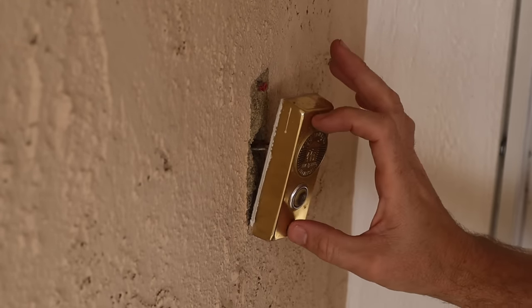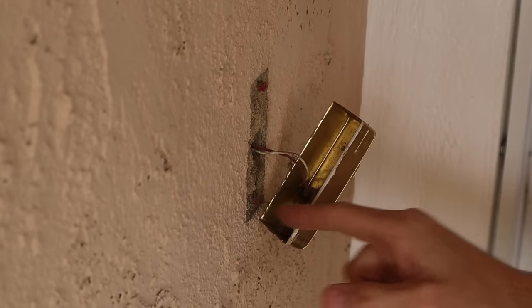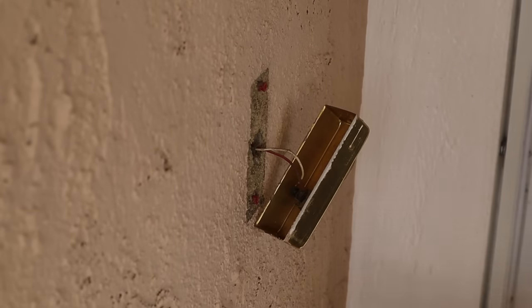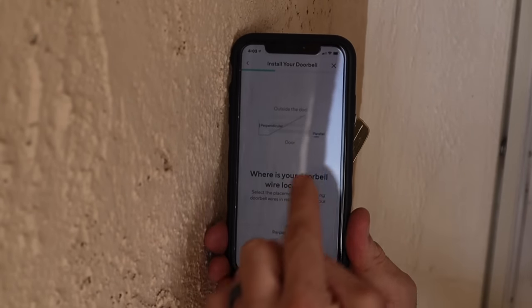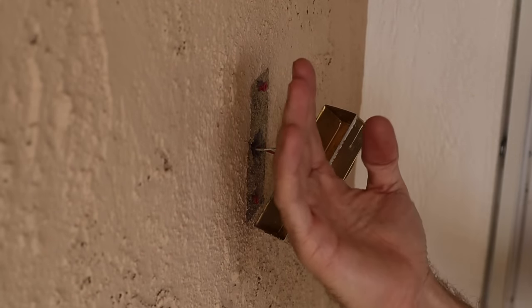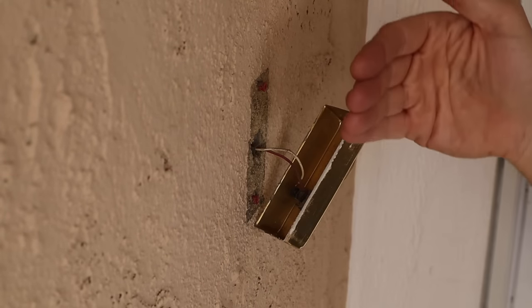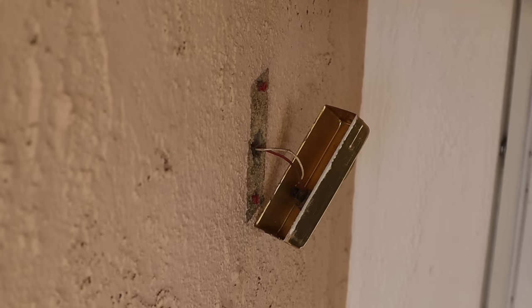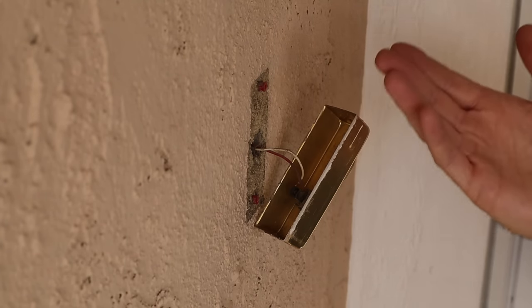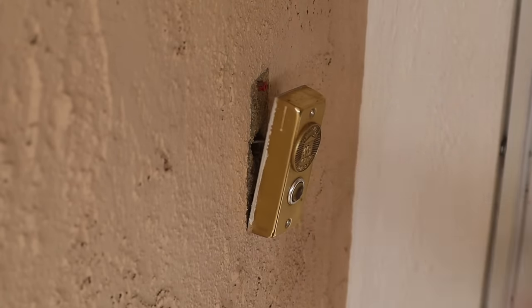So we've got it off. Your doorbell will probably have one or two screws underneath it and some plugs in the stucco. As a reminder, your phone app has the step-by-step directions, so if you're missing anything I'm saying here, you can always refer to your phone. The app is going to ask whether you have a perpendicular or a parallel mount. This is a perpendicular mount because our door is on this plane. We're going to use the little wedge so the camera gets kicked out for a better view.